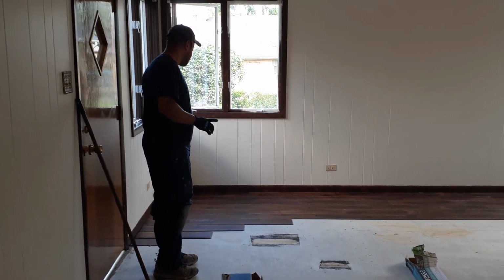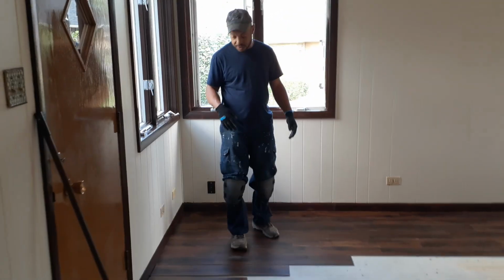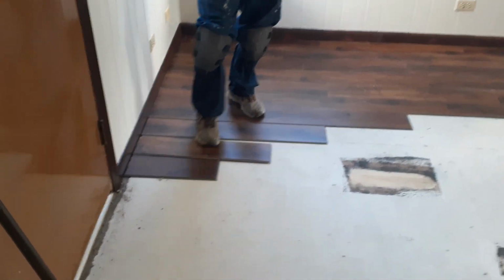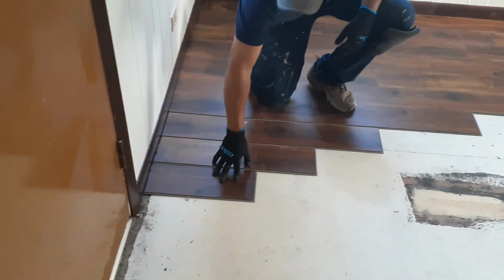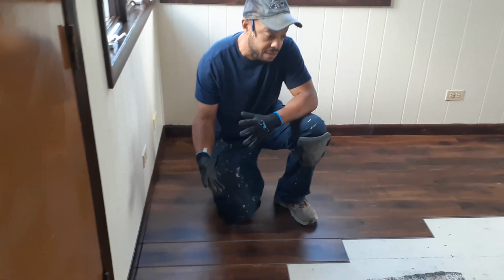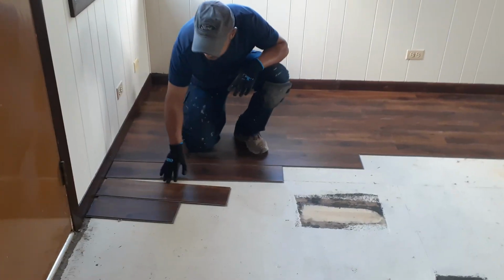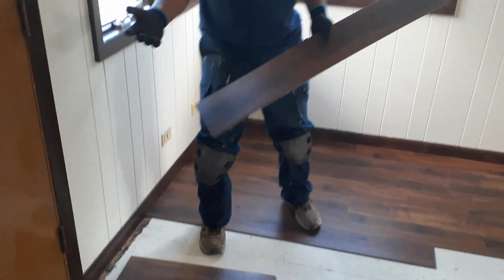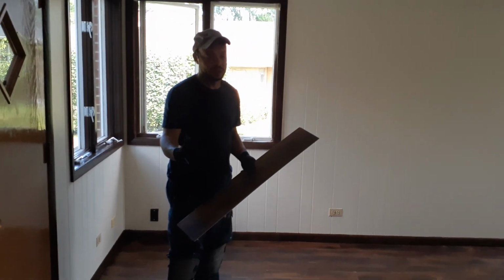So basically, the way you start off is you want to stagger your joints. You can bring it a little closer. Stagger your joints. Okay, so what I do is I got several pieces of 3 different sizes. It's full size and 3/4. Then sometimes you want to go a half, just a little more than half, but it makes it a little more convenient. As you see with any vinyl tile, people sometimes get mystified. They're like, oh, vinyl or laminate, vinyl or laminate. Vinyl is just as good as laminate. It all depends on the application, you know, what you want to pack.